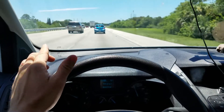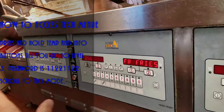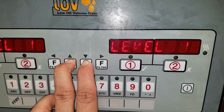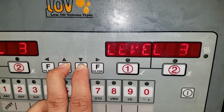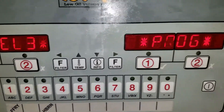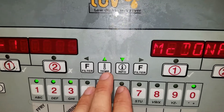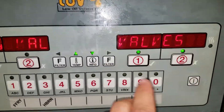Alright, here's what we got to do. I just pick one of these vats — doesn't matter — hold the two middle buttons until you get to level three programming. Password is 1-1-2-2-1-1-2-2 — very complicated. You want to scroll to see tech mode, and then go to valves. T20 is your valves.